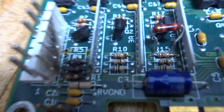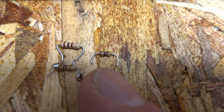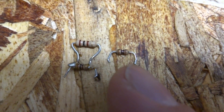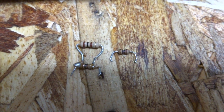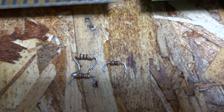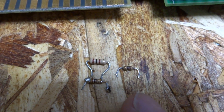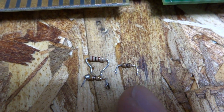So what we're going to have to do is go through here and replace all these resistors and go from there. I've taken out a couple of the resistors located at R5 and R4. You can see there are some scorch marks on the plastic as well as on this resistor pack — a little bit of overheating. But luckily on this resistor the color bands are still intact. For those who don't know about resistors, they do exactly what the name implies — they resist the flow of current between two points.